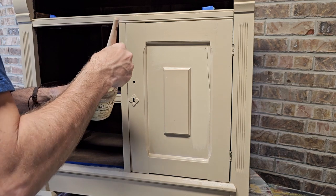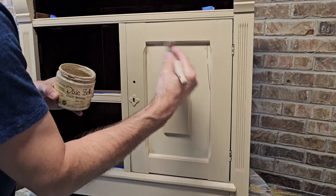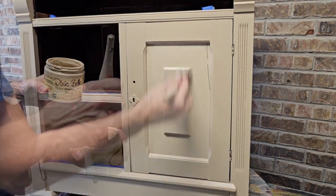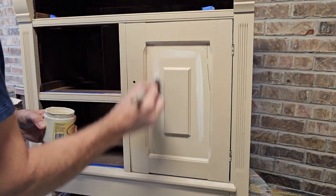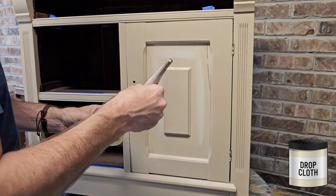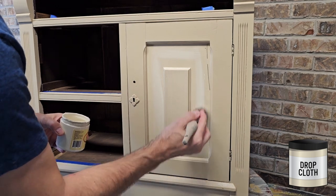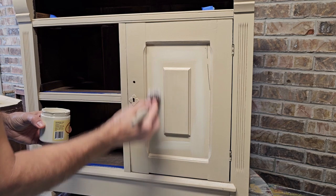The key is that you have enough paint so you can blend the two colors together. Once you're done putting the first coat on there, take another brush and keep that dedicated to the second color. Apply it in the areas you want to blend. Here I'm using Dixie Belle's Drop Cloth as a lighter color to Burlap, and you are basically mixing the colors as you're painting that on.